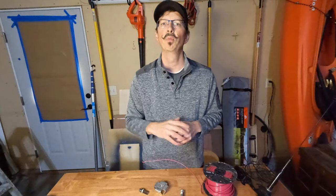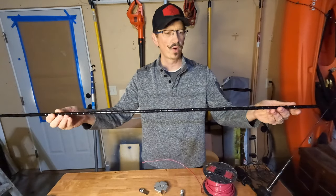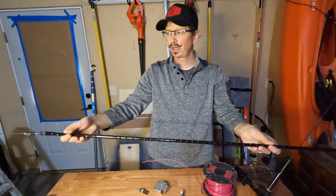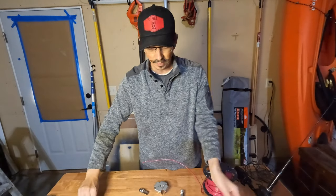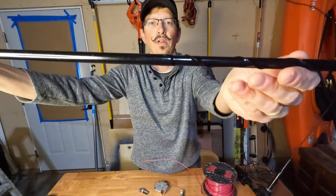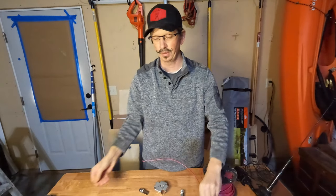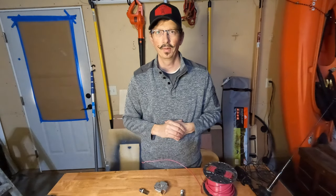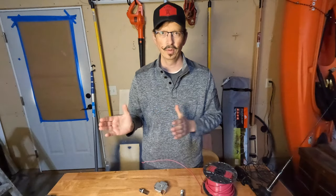There are lots of different ways to shorten antennas — we'll maybe do a whole video on that. The same concept applies to a hamstick. This one is for 20 meters, and if you look closely, it has a coil on the base and then the vertical element goes out. Here's a hamstick for 75 meters — the coil is so tight together it's almost hard to see, but the bandwidth is almost big enough for just one signal, so you definitely have to tune it. It works well for digital modes where you're not moving around. I typically put a tuner on it to give myself a little more agility up and down the band.